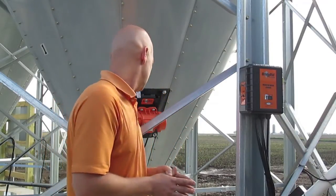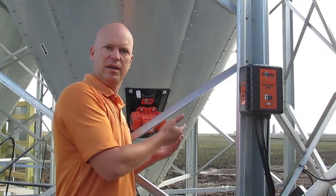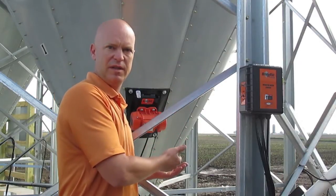The control box also offers a manual switch as a convenience. For example, if we've got a load of pellets that were hot and have been in the bin for three weeks with some mold issues, or if we got a bunch of rain in the bin — when in the manual position the vibrator will run, allowing you to rectify the situation. When you're finished, make sure you return the switch back to off or auto, as the vibrator will continue to run in the manual position.